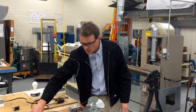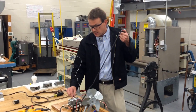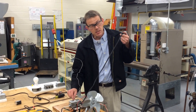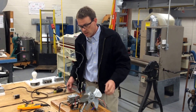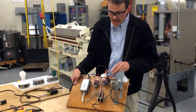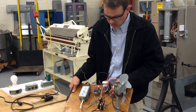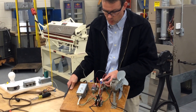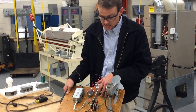The way this works is you're going to have a power cord coming in at 120 volts. You'll break the black wire through the single pole switch. The white will connect and go right to L1 on the contactor, and then the black one is going to go right to L2 on the contactor — L1, L2. The transformer's 120 volt side also feeds to L1 and L2 on the contactor.